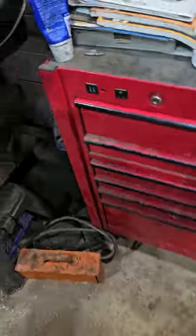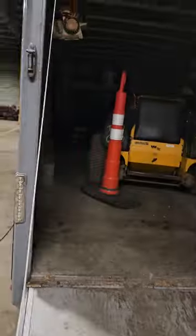Tighten these up. Now I've got the tension taken off and the cables are set. Test the door on the outside and make sure the cables stay at even tension. That's looking good — that's how you replace door cables.